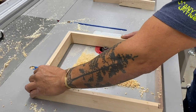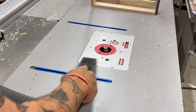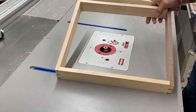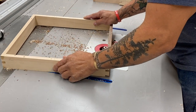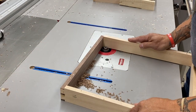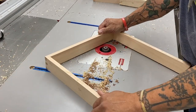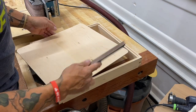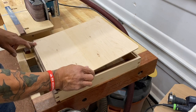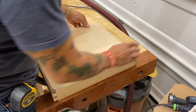If you've watched my YouTube video on making drawer boxes, you know I'm not a big fan of a groove for a drawer bottom. I like it nailed on directly on the bottom, or if you want a cleaner look you can cut a rabbet to create that same strength because you can glue it in solid. I'll typically make multiple passes — reverse cuts or climb cuts to reduce or eliminate tear-out — then do one final cut in the correct direction. After using a belt sander or edge sander to create all the radii on the four corners, I can use a sandpaper block to touch things up and get a perfect fit.